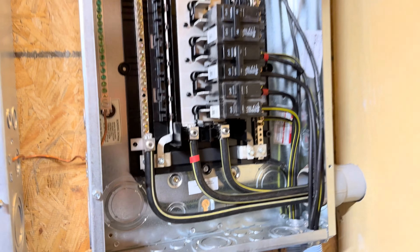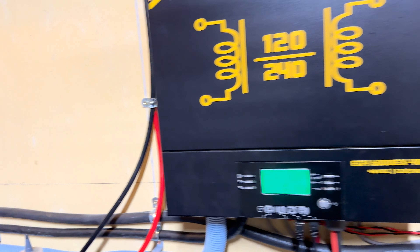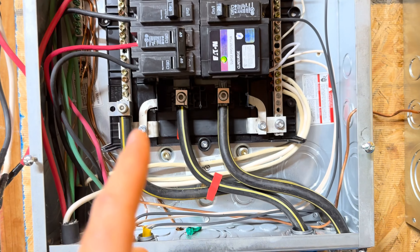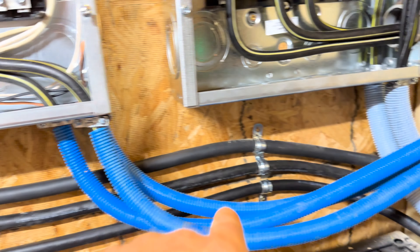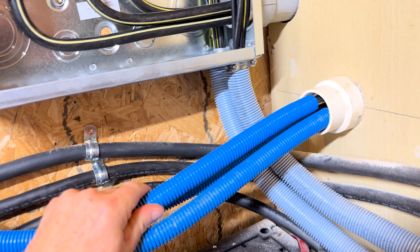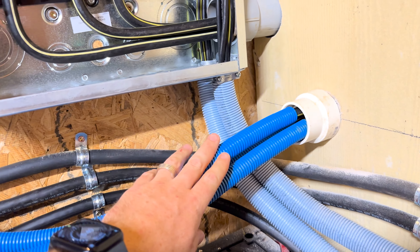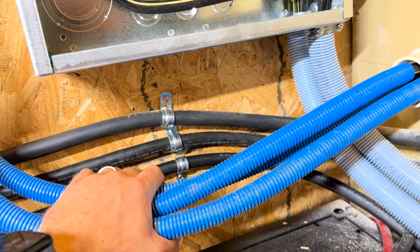It's nighttime because of daylight savings time and all that. You'll hear some inverters humming because I've got one inverter going right here to power the barn — we disconnected our temporary line to the house, and now we've got these two-aught cables coming through here. I know this is kind of crazy the way we're doing it, but I think it works. It's probably not up to code, but at least I don't have exposed wires — I've got each of these going through some small flexible conduit I had laying around.